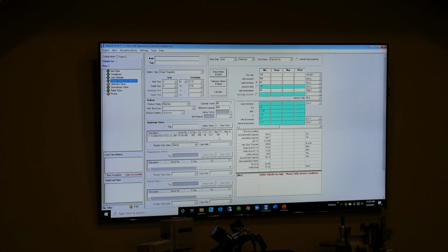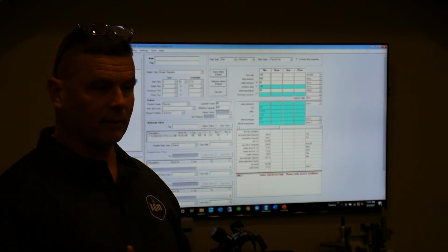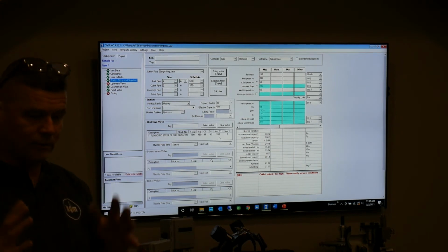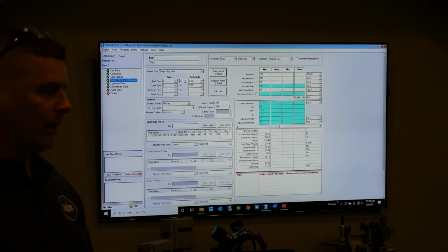Look at your capacity chart and tell me, in a 2-inch body, with what ANSI class would the connections have to be? 400 inlet. 300. They may say 600 if the rest of the system is that, right? Because they don't want to deregulate it or degrade it. So yeah, it's probably going to be 300 class.